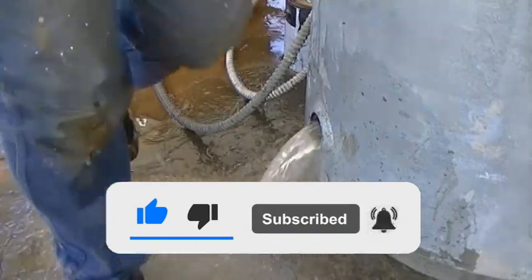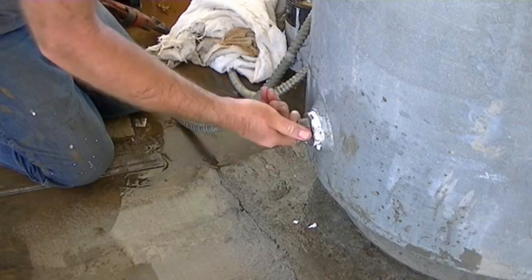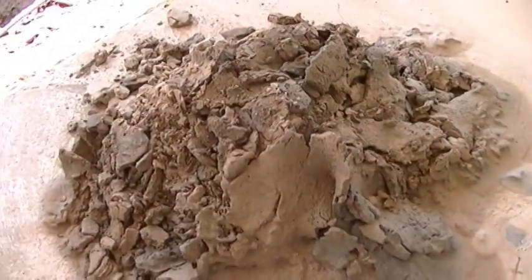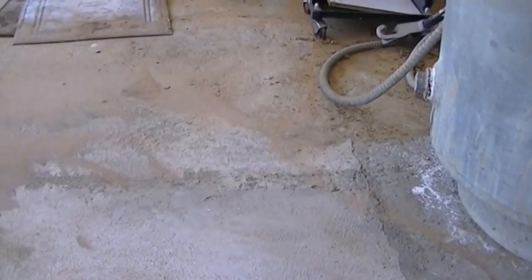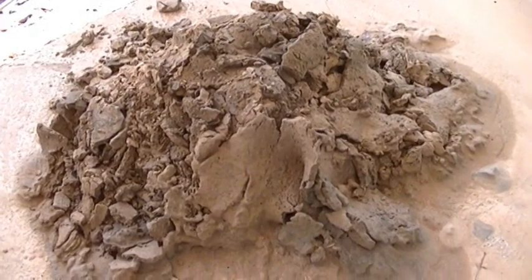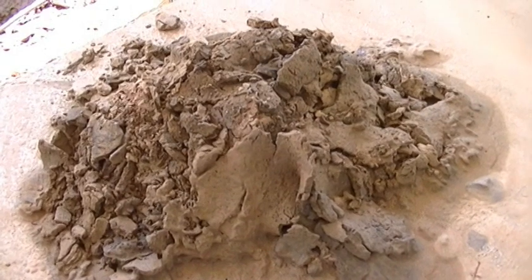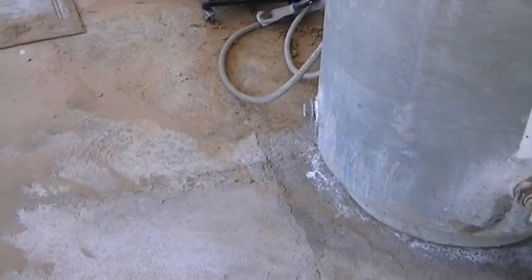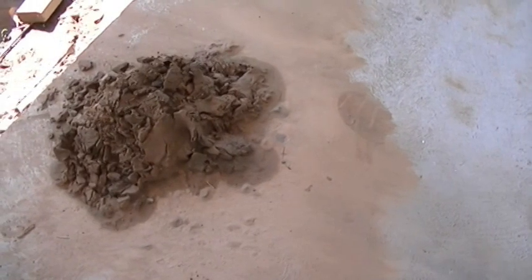I'm going to go ahead and turn the pump off here and put the plug back in. Look at this pile — that is the sediment that I scraped from around that plug from yesterday when we did the clean out. It's dried up and I went ahead and scraped it and just dropped it in a pile. That is just a fraction of it — most of it ended up out in the field. But there's a big pile that was built up on the slab around the well. So that worked out really well. I would advise going ahead and cleaning this thing out every couple, three years to keep that from building up. And when it builds up, trust me, it gets into the water supply and you have dirty water.